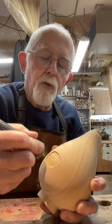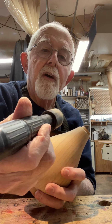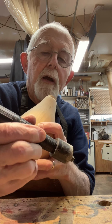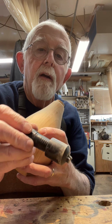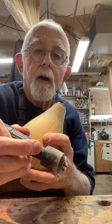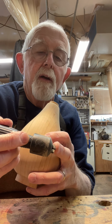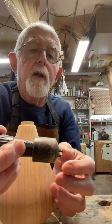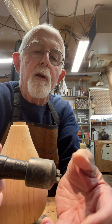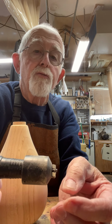So anyway, piece of 1-inch UHMW drilled in the backside so that it fits over the nose of the handpiece. I've got a couple of set screws, one there, one on the other side, where I can kind of snug things up and keep them level so it doesn't want to wobble around. And then a little cutting and nipping on the other end. And you can just loosen up the collet and adjust the depth. I don't want to do it now, I've got this set. But you can adjust the depth and just work to that.